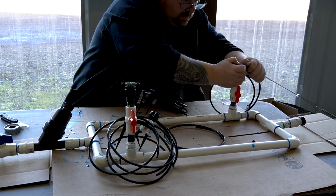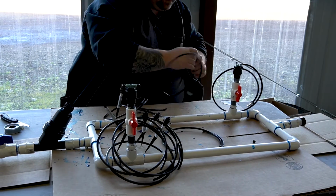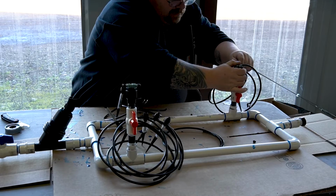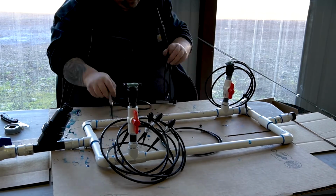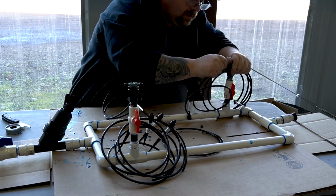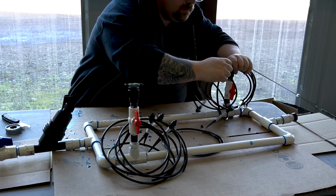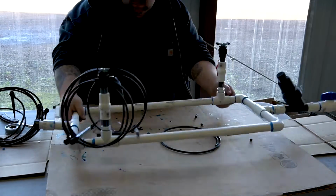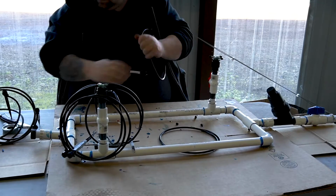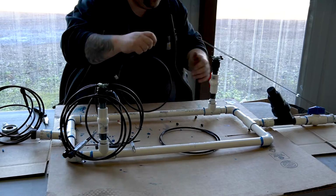There is a ball valve located beneath each 4-way junction, so you can shut that off and only run one or the other. Make sure all lines are pressed on over the lip of the end of the nipple, so that there is no leaking when everything is turned on. This is much harder with hard pipe than soft pipe.